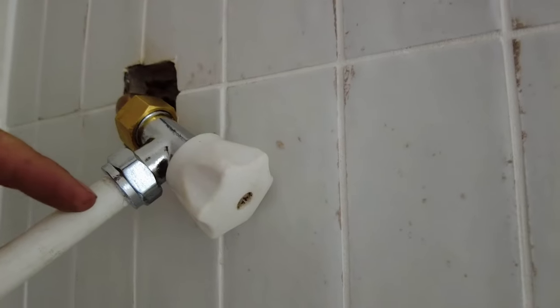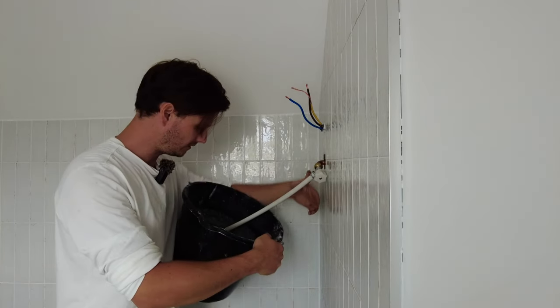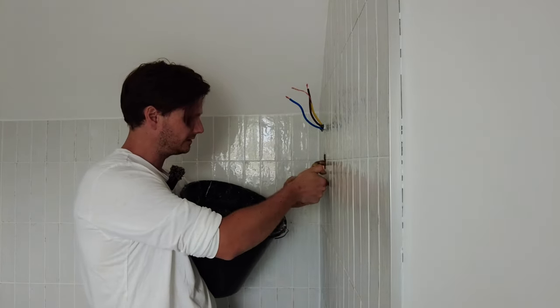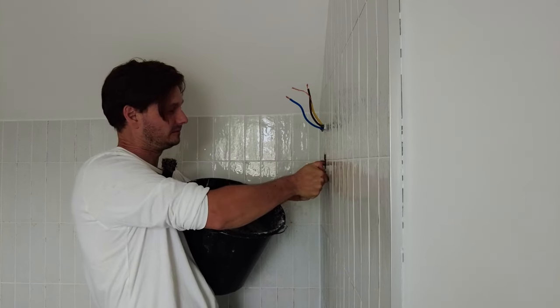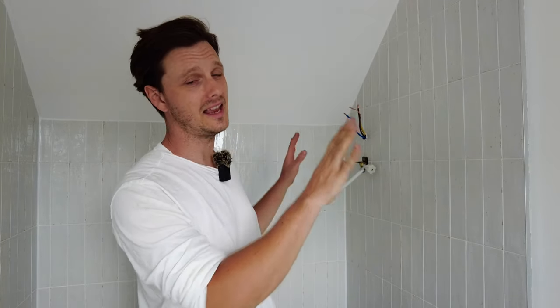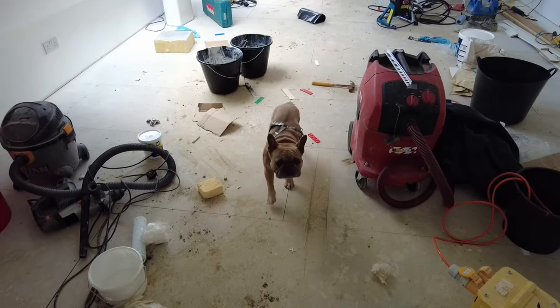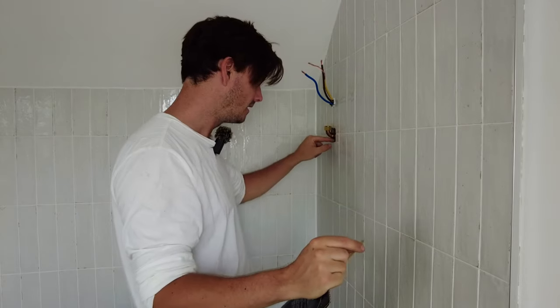So I'm thinking now instead of putting it all on, maybe I can get a valve and whack it on there and test it if I've got the right stuff. Let's go and have a look. There you go, that'll work - radiator valve. Just turn the water on. Nothing's happened so far. Looks like it's holding under pressure. I'm going to go for a quick walk with Arthur, leave it for about an hour, see if there's any water anywhere. Thing is I haven't checked any of this pipe work in the walls so if there is a leak we're going to be in trouble. Success - that didn't leak.